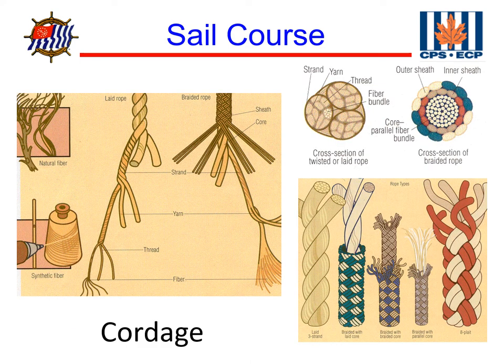Let's go over again how these ropes are manufactured. We've got a spool of thread that we start combining — the fibers are rolled together into a smaller thread, then those threads are spun together three at a time into a slightly bigger rope, and then those are combined into a larger rope. We just keep expanding the diameter to get whatever characteristics we want. That's called triple-strand laid line. For braided line, we start with the same fibers but braid them into an intertwined line; these lines then become braided and overwrapped as we go. You can see the crisscrossing — that's the braiding process.